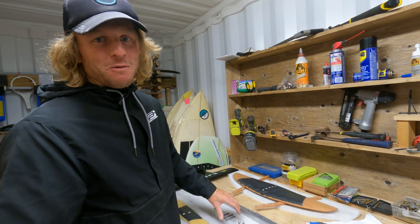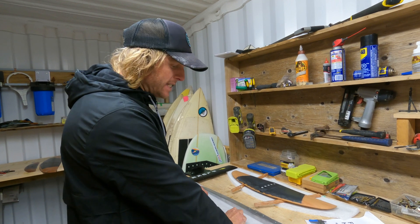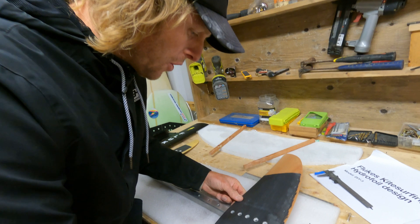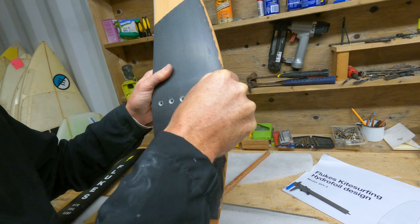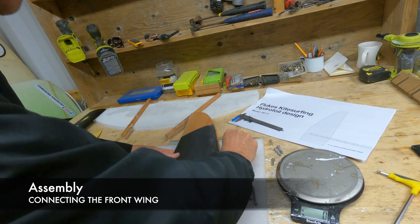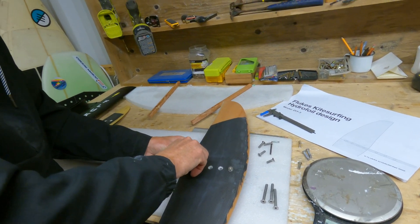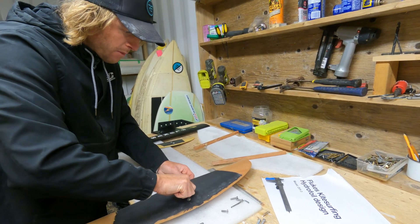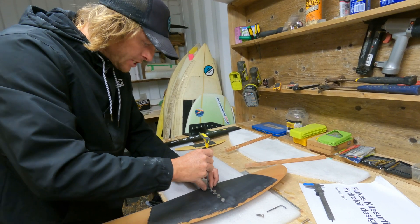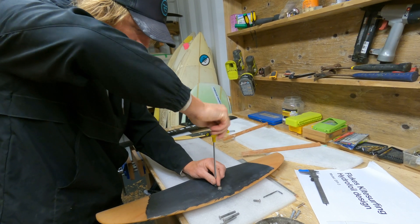So this is a big moment of truth — we've measured all of our holes and now we're really hoping it all lines up. While we're assembling it, if it doesn't line up perfectly, you can put the drill in, wiggle it slightly, loosen up that hole, and make sure everything goes together. One of the keys to success here is measuring and drilling from the two sides that actually touch, so all of the measurements are on the faces that are going to screw together. I like to just get a couple of them in slightly first to make sure they're all going to go before you tighten anything up, just in case it has to slide around.